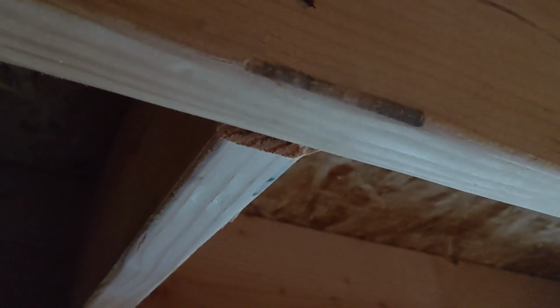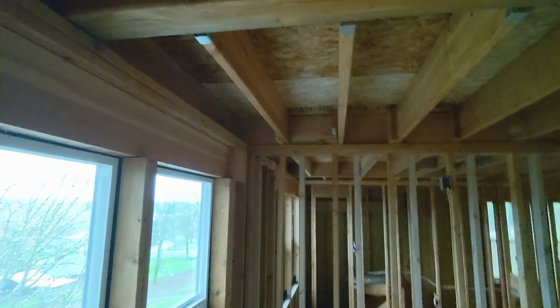It went in just fine on this side. But then on this side over here, you'll note that we have, that's more than an eighth. That's 3/16ths, I would say. And it's hard to tell, but I can feel that it is flush to the wood up above. So I'm probably going to end up having to shim here or shave this. And it'll probably be on every one of these that we install, and the 2x12s will be worse. On these 2x10s, I'm just doing three nails, could fit four, but about every 2 inches a nail, and then one nail, two nails, and a nail up through the bottom. And I probably will do like I did everywhere else if I can get in there and do it, one down and one down, which is what they called for elsewhere in the building whenever you butt into the wall.